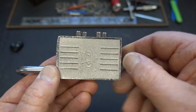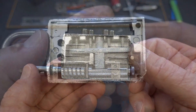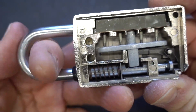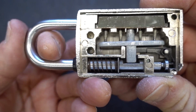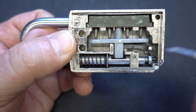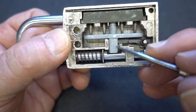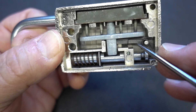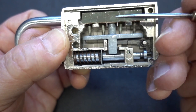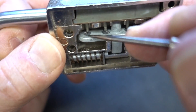I'm going to break off this ledge, pry that off, and figure out how that works on the inside without having magnets. This really turned out to be an interesting little mechanism — pretty simple, but here's how it works. Remember, this locking shackle is spring-loaded in reverse — it pulls itself closed. Because when you pull on this, the locking shackle can't come open because the locking pawl is in the cutout. The way you move that out of the cutout is on the back there's a little lever, and every time you pull on that, that little lever is trying to push that locking pawl. It can't move because these four little dancing posts have to line up perfectly with the holes inside of this locking pawl.